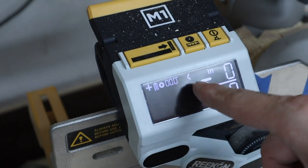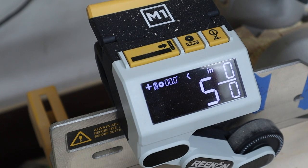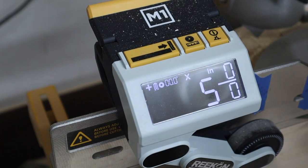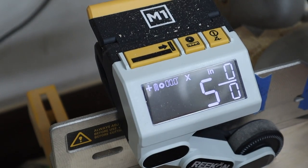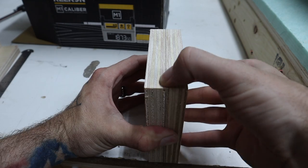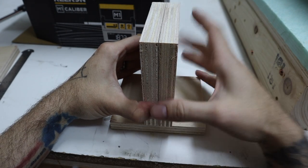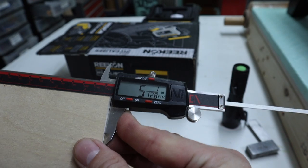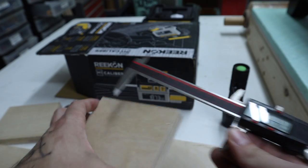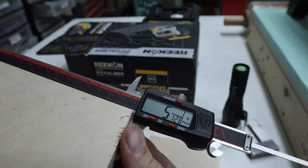It's sensitive enough that even if the board isn't flat, it's going to make a difference. We're going to aim for a center five-inch cut both times. Right there — that's center five. Look at that. That is impressive by all accounts. I would have a hard time replicating two five-inch cuts this close together on the first pass. Let's see how they stack up — there's some calipers. That's five and one one-hundred-twenty-eighth. That's five and one-sixty-fourth. Five and one one-hundred-twenty-eighth — that was just crooked.